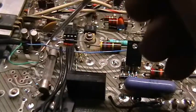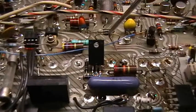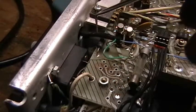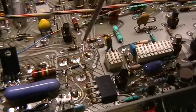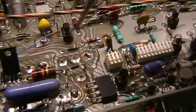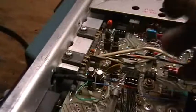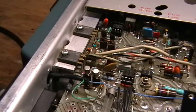And here you can see where I tapped into the internal supply to run the computer fan out on the back side, which is coming out via this wire. And the other bridge rectifier was fine, while one of the other diodes had failed and had to be replaced. Luckily though, none of the main series regulator transistors had failed, which was a relief on my part.